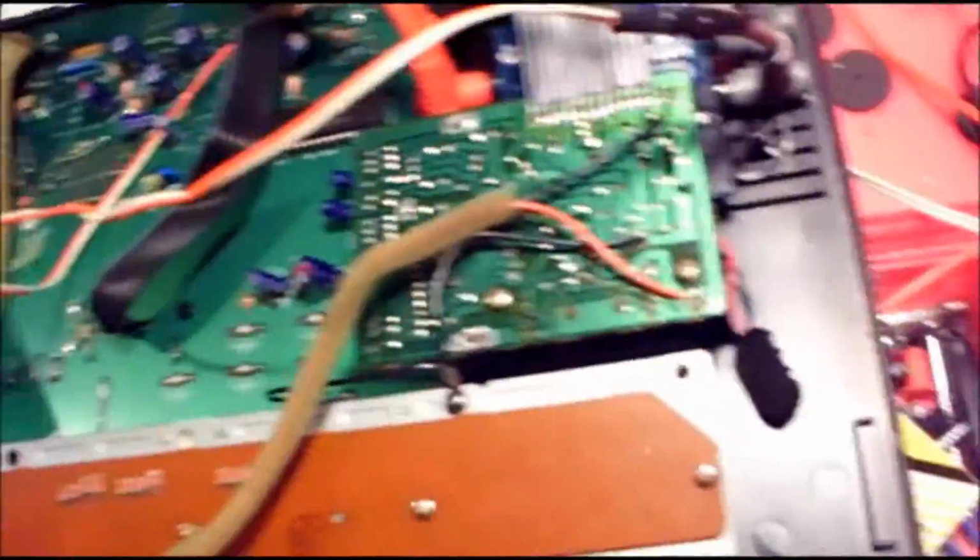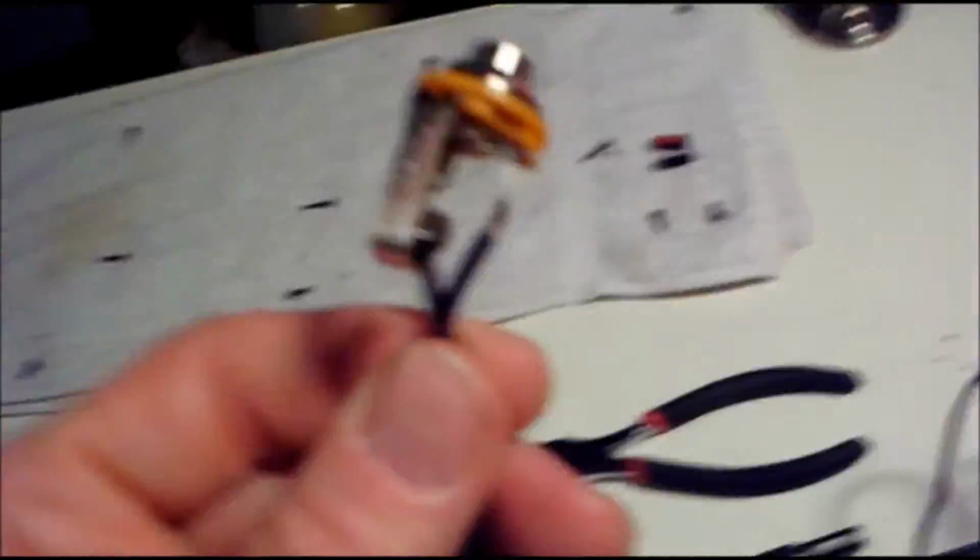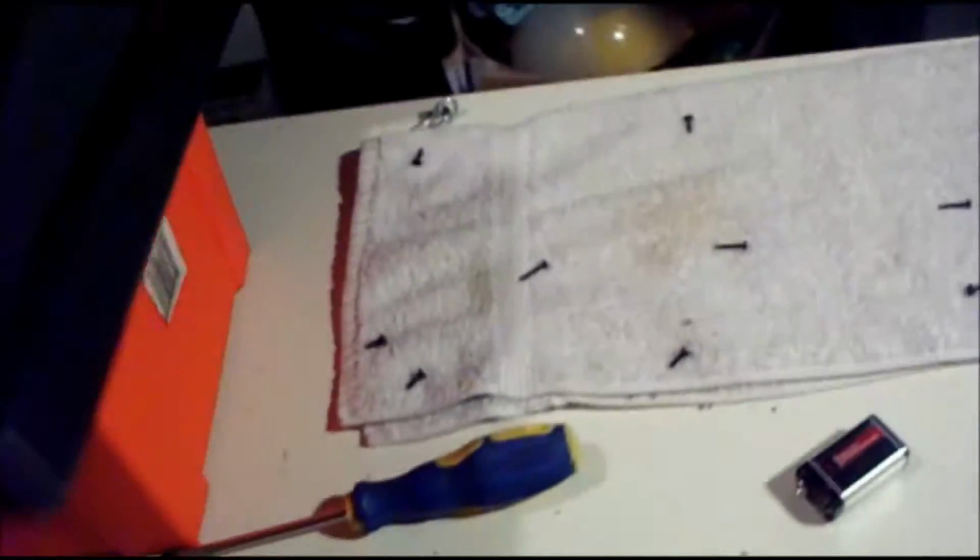This goes to the battery compartment and is probably just going to get disconnected and not used at all. From the speakers, where they would go to the speakers goes to the input on this side here, and then the output goes to the 1/4" jacks, which are going to be installed here. And that's not the most convenient place in the world for them. It's not the nicest looking, but it actually is the most convenient. It's the safest. It's raised right around this area and well above any of the components.